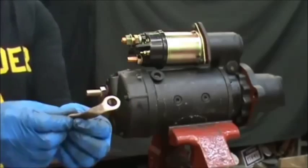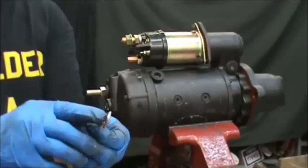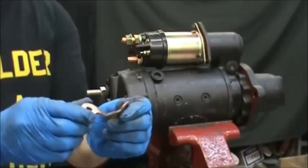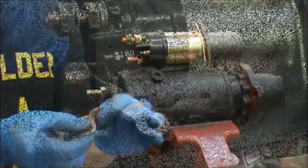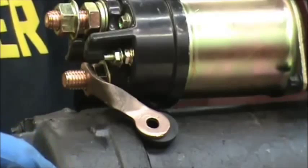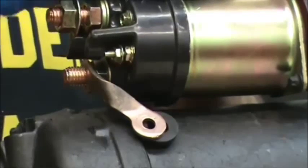The most important thing is we have to very very carefully clean both sides of these terminals, because these are high amperage contact points and they have to have white lithium grease smeared on all four of these places. We've installed the three quarter-twenty bolts that hold the solenoid on and you want to finish tightening them down about three-fourths of the way.